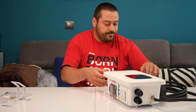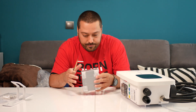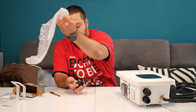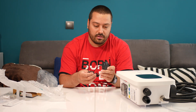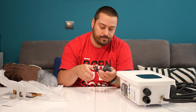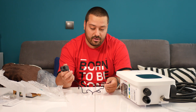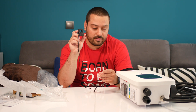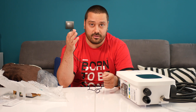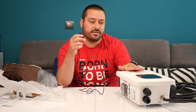For the communication, I'm prepared — we have this little box. What we have here is a little clamp that you have to put on the AC side in the inlet of your home. So when the car starts charging from the PV and you don't have enough power from the sun, this will detect the inlet. If it exceeds the power that you set from your application on your phone — the minimum I think was 1.4 kilowatts — the charger will stop charging the car because you don't have enough power.